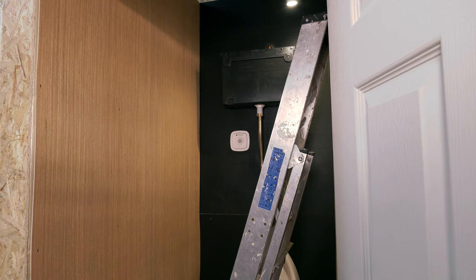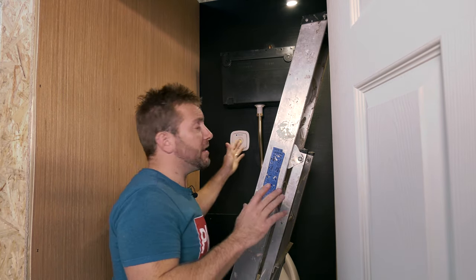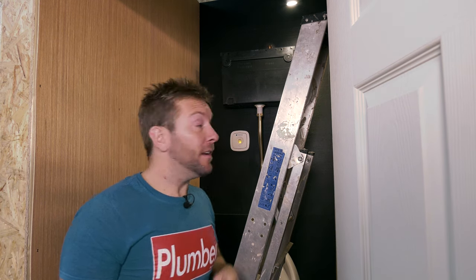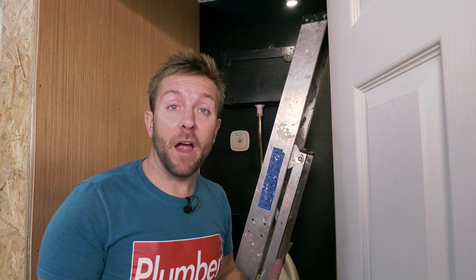After that guys, just wanna make sure that it can see us. So there we go, now we know that it can sense us coming in and out of the urinal as well, and it will start to let water through. After about a minute of doing this test, it's commissioned and it's set up. Then what we can do is deliberately trigger the fill valve, and then we move on to the very last bit of commissioning, and that is actually what fill rate we want to attain.